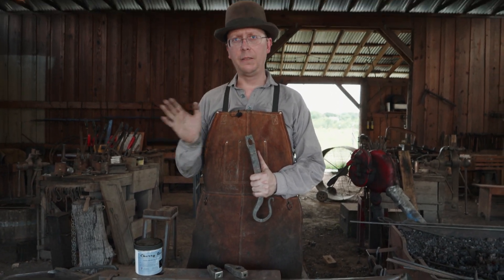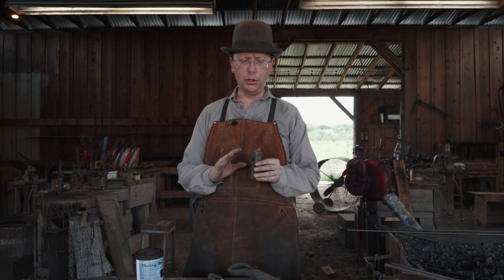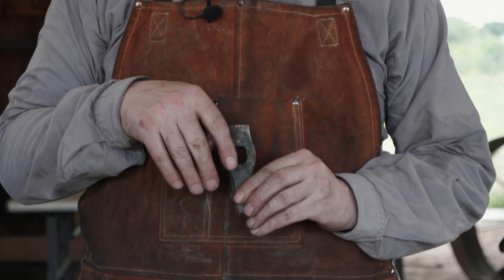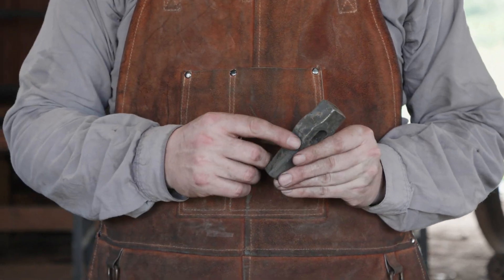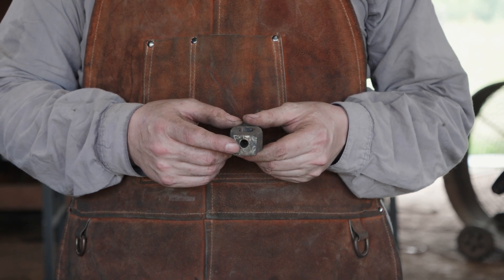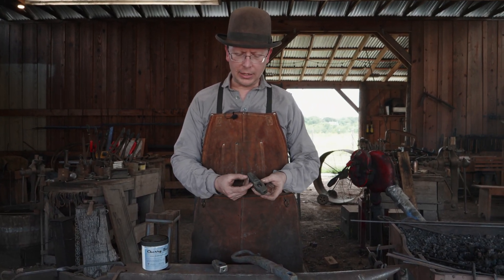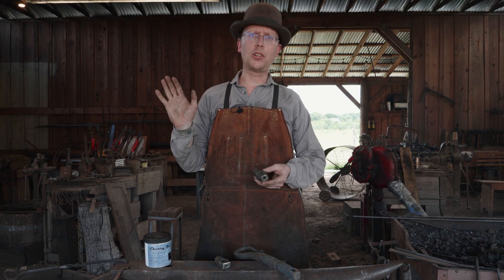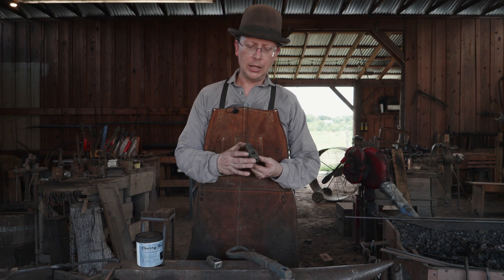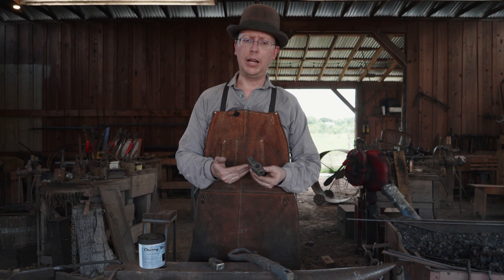Eventually I said enough is enough, let's start over with a fresh piece of steel. Attempt number two went really well. The flaws it's got are maybe a little off on the straightness of the hole - that's not a huge deal. Cheeks came out a lot better. Things did go pretty badly when I tried to drill using the drill press with an unsteady table - just didn't get it centered well. With the extra length and the hole not centered well, I decided to start again.